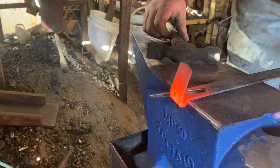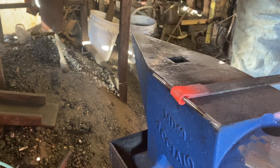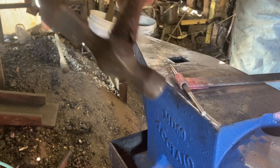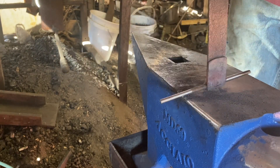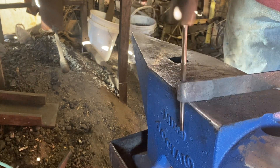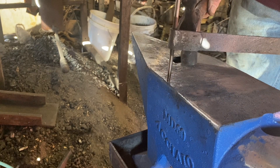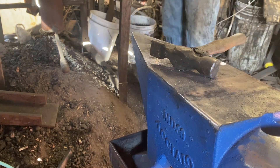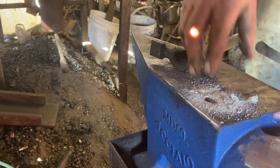What we're doing is making a nice little piece for our drift to lay. I'm gonna lay our drift in — the little thing wants to fall out, but there we go. We've got our drift in there, forged around, got everything pulled up tight like it should be. Get our drift out. Now we're gonna flux this and forge weld it.